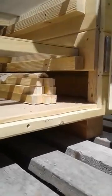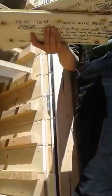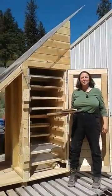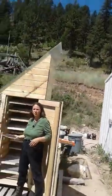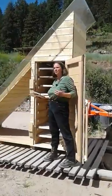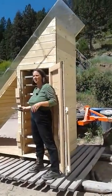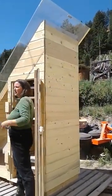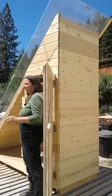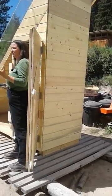While I'm here, these are two sample boards of the milk paints that we use. We did try a wheat paste paint first, which was a nearly dismal failure. Wheat paste is a good archival glue for gluing paper to paper, and we used it on another project that Fred had worked on because I thought it was nice to honor Fred being vegan by not using animal products in the paint. But it turns out that when you put wheat paste in a high temperature application, it bakes into little crispy cereal flakes. In this case, crispy cereal flakes full of charcoal.